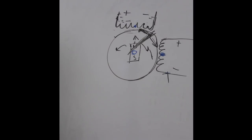Micro stepping is basically controlling the voltage in an analog way to move the rotor within any part of that half-step region. We won't get into that too much, but at this point we're ready to move on to the demo. Let me give you a quick schematic of what I've got over there.